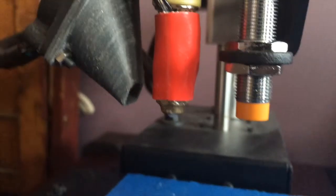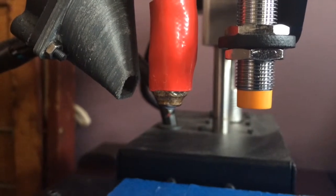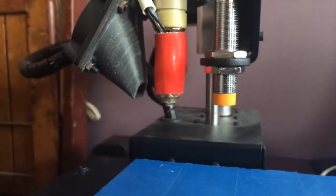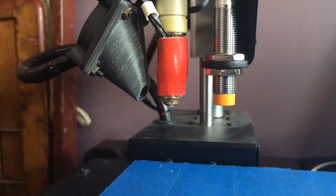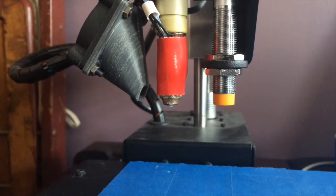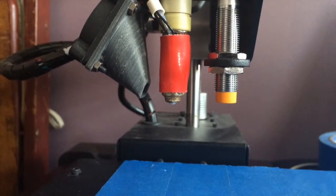Even at 230 degrees, I couldn't get the filament to pass through easily, at least not the way it used to. So I did some research, and it seems that these things need to be cleaned by being dipped in acetone or some other type of lacquer thinner for a few hours, practically half a day. So there's not going to be any printing until tomorrow.